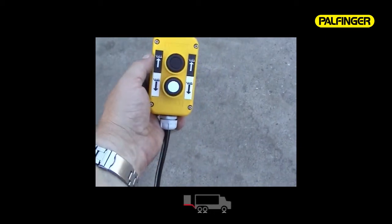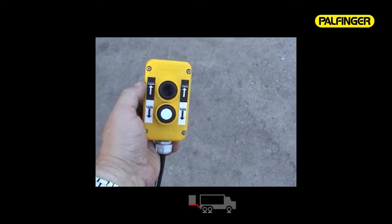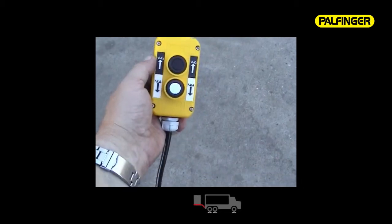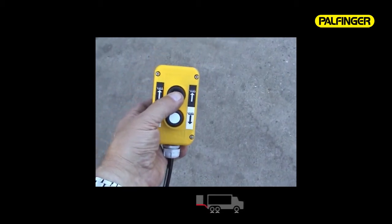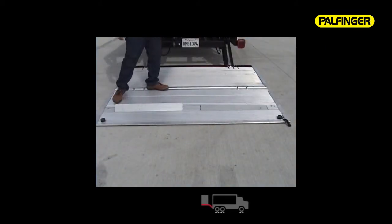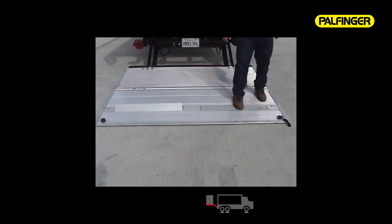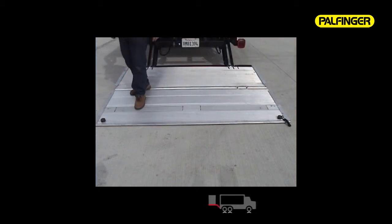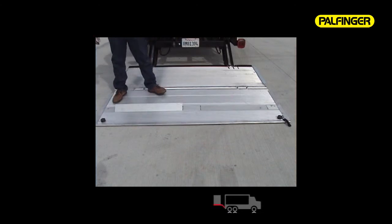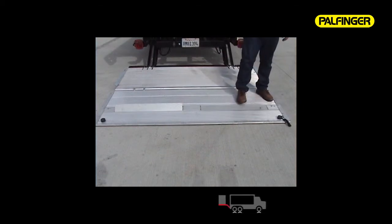Pushing and holding the down hand remote button lowers the platform straight down. Pushing and holding the up hand remote button lifts the platform straight up. Continue to hold the down button to allow the platform to tip automatically to the ground. The ILT also has integrated spring-loaded cart stops as an option. Simply slide the lock and the cart stop pops into place, preventing rolling loads from moving to the edge of the platform. Once on the ground, push the cart stop down and slide the lock into place. The lock is also a slam-type lock that can be moved into position before closing the cart stop.